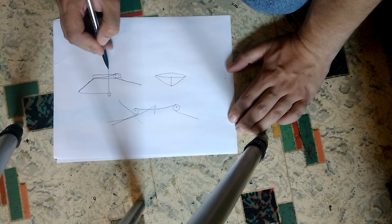The next theme that came through again and again was to use a single arm, because with a single arm you haven't got those unbalancing issues. This is not the quick part of the device — it's a slow feeding in of power — so in theory a single arm works. Scott McDivott came up with a really simple solution: one fixed arm, a cord with a sliding point on the center rod, going down to one rotating arm. Really nice simple idea. My gut feeling is there'll always be some slight imbalance, the central rod will end up getting bent, you'd need to make it bigger and heavier, and we're back at the beginning. Nice simplification, but probably won't work either.